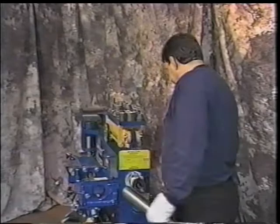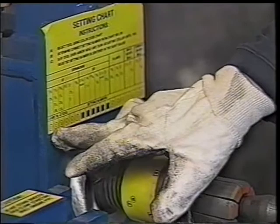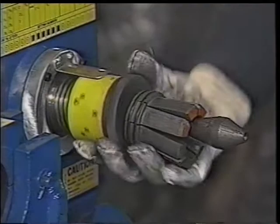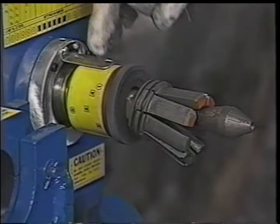We'll go to our scale. We want to go inside diameter. We want to go 2 1/4. And so we look straight down below that, and it shows that we need to have it set on the round 2. So we'll want to run that tool back in until we get right to the center of the round 2 into that sight glass. Once we're in that sight with the round 2, hold those fingers together.